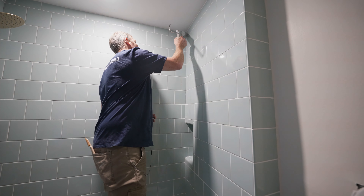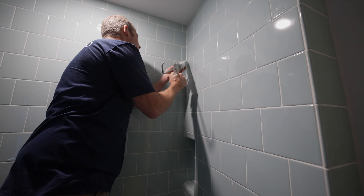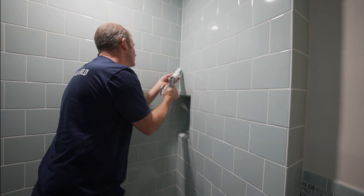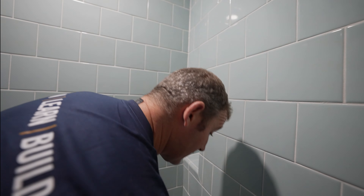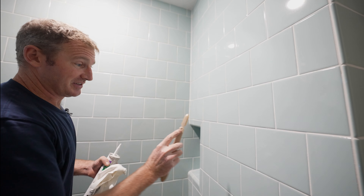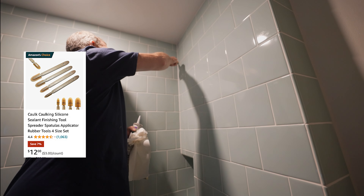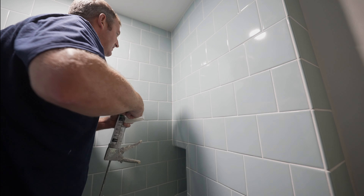Just try to be continuous with your joints, filling that entire corner. Then use a little bit of Windex — I like using the clear stuff because I don't like the dye in the other stuff. One of these little caulking tools is kind of nice; it's just like a fake finger almost. You can apply a lot of pressure and then remove the excess silicone.